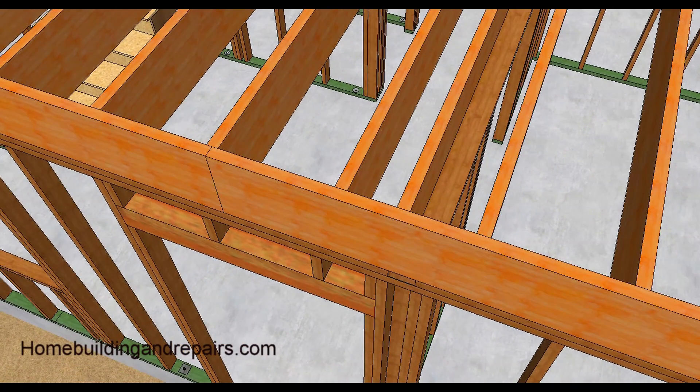Take a look at how we install the backing. You can see the joist here is on one side of the wall. Always a good idea in a situation like this to put the joist to one side or the other so that the plumber and the electrician can get through if they need to. If you put the joist right in the middle, the electrician is going to have a hard time drilling holes for wires and the plumber might not be able to get pipes in there.